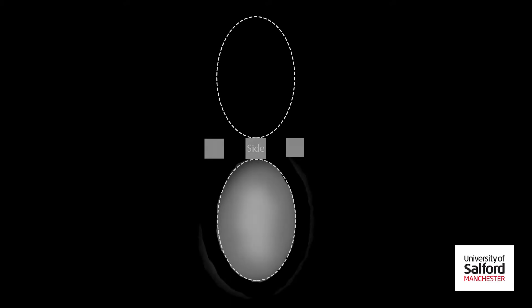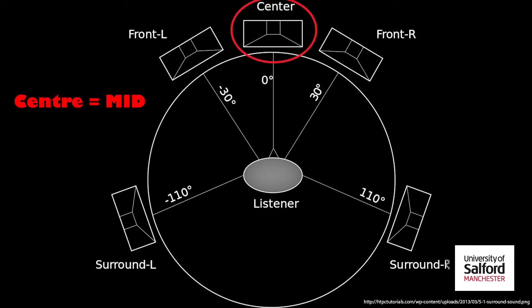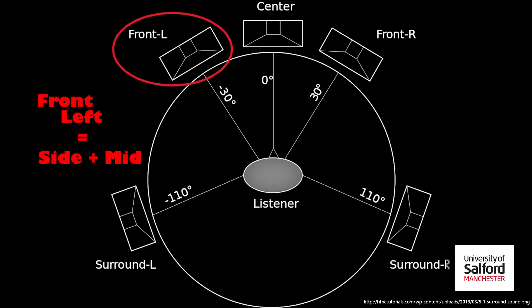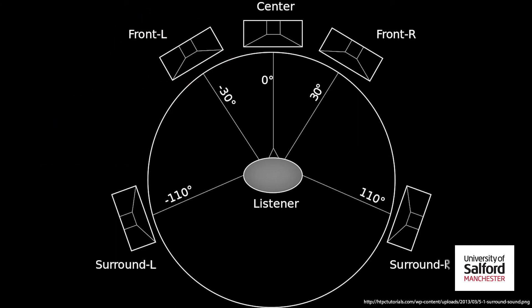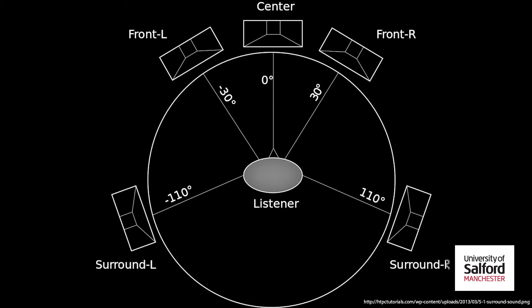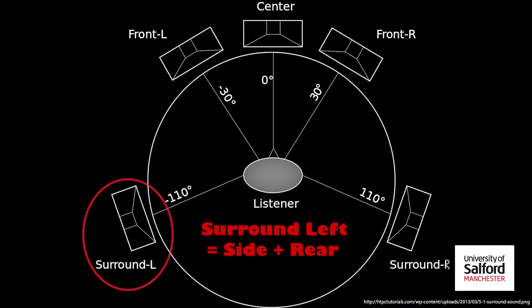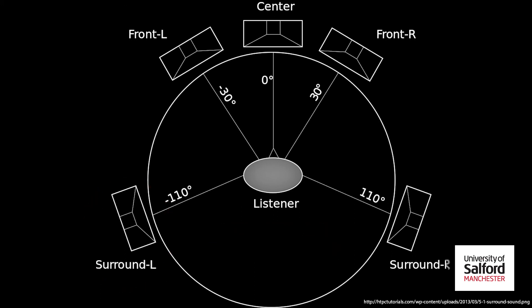This can be done in the EQ settings. In your 5.1 array, you want to decode these signals. You want to have the mid mic — which is the front-facing cardioid — going to your centre channel. In the left channel, you want a mixture of the mid mic and the left-hand side of the figure-of-8 mic, which is still a regular signal. In the right channel, you want the mid mic and the right-hand side of the figure-of-8 mic, which is phase inverted. The rear mic still hasn't been put anywhere — that's simple. In your surround right and surround left channels, you'll want to send the left and right signals from the figure of 8 respectively, and include with them the rear-facing mic signals as well.